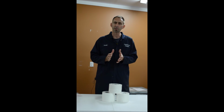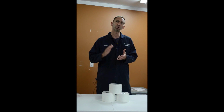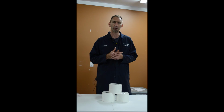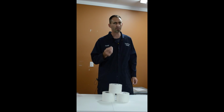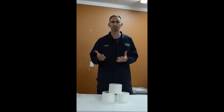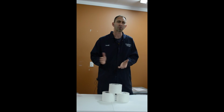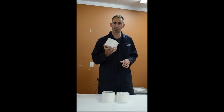And one of the other tips that I want to give you when you install this is the foundation pins. When you drill the hole into the wall to attach the foundation pins, that concrete dust is very fine. It's very difficult to clean up. You really need water in order to get the majority of it up. Wiping it or sweeping it isn't enough to keep it clean enough to get a good bond.